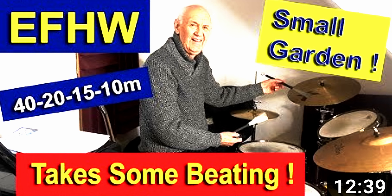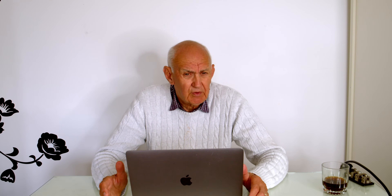You probably want to move around and be a bit more agile and try different bands. You could use what is known as an end-fed half-wave using the 49:1 transformer. I've done several videos on this, and below this video I'll put links to those end-fed half-wave videos. The advantage of the end-fed half-wave is it covers several bands and it's very easy to erect, but it still doesn't cover as many bands as something like the half-size G5RV. I've done a very recent video on that and I'll put a link below.